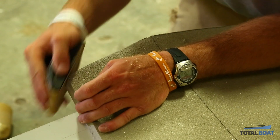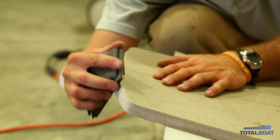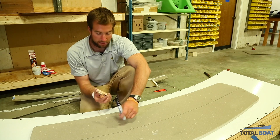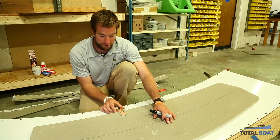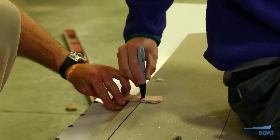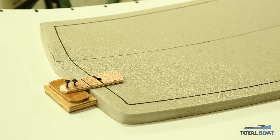You can then tack in your corners with a smaller block and your ends as you wish. After that, you're going to get ready to start shaping the top of the board. The top of the board has a slope that starts about one inch in from the end. So I made a little tool to trace one inch in from the end — it follows the track and the Sharpie fits into the hole, so you can get a nice consistent line. That way when I'm sanding, I know exactly where I am on the board and can keep my shape consistent with a consistent edge all around.